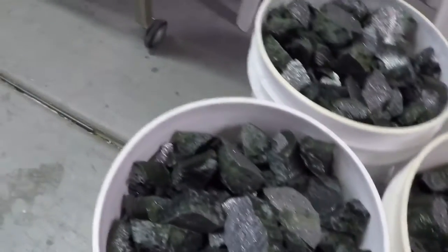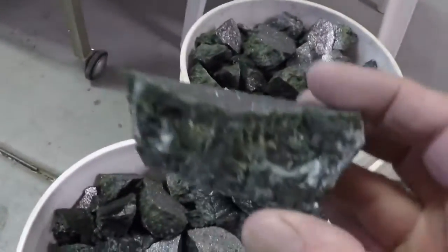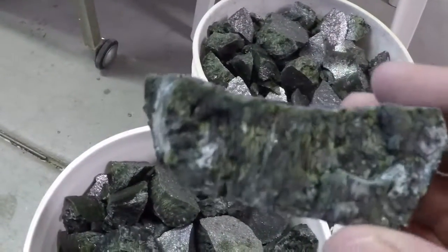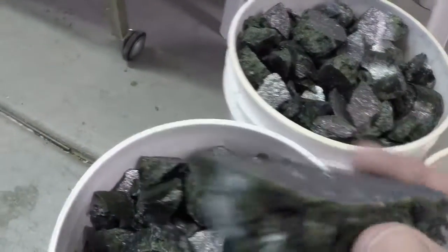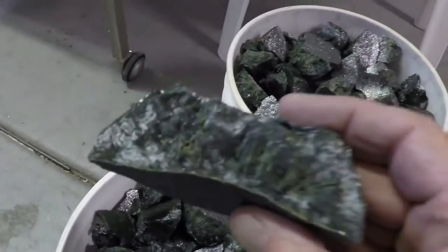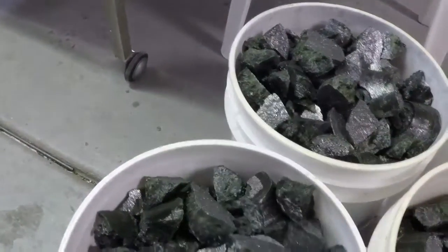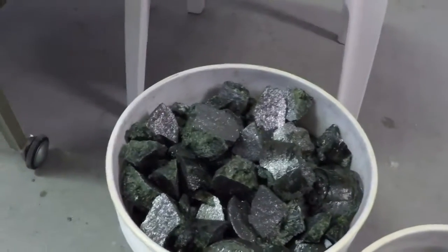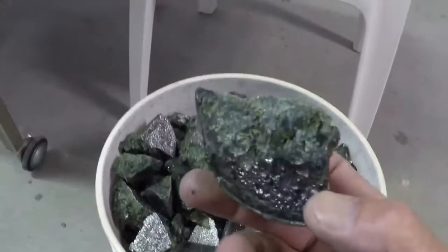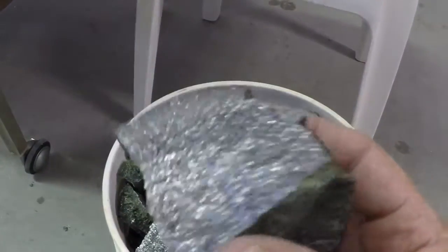In other words, 600 grams of the material went in the crucible along with 600 grams of flux. The flux is kind of a green color after you fired it — it pulled all the iron out. The sparkly shiny surface that you see on this is where the graphite crucibles shed as they get worn. There are three five-gallon buckets of flux and there's still a little bit of silver in here. I'll go through it again and get a little bit of the silver out, but every once in a while you'll see a little bead — though there's not a whole heck of it. Most of that shiny stuff is graphite.